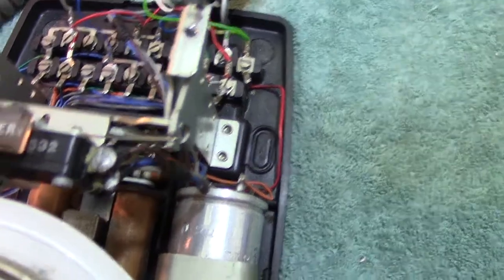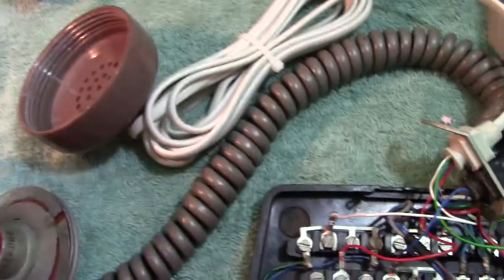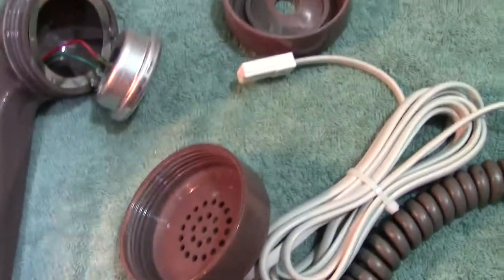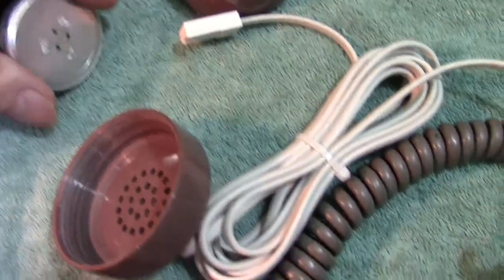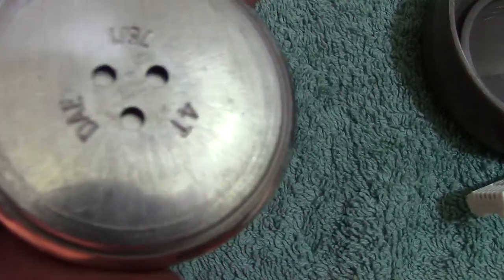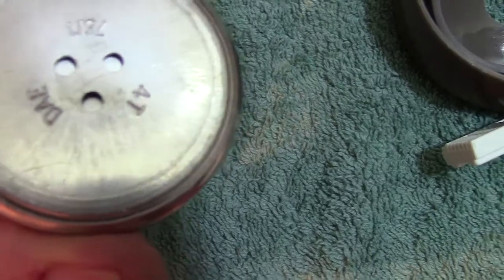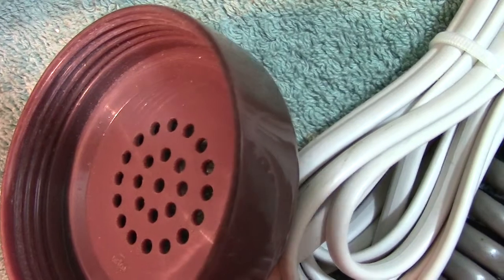Plessy and Ericsson were just one of the actual makers. Now, leaving the telephone part, we go on to the handset. It's interesting because the 706 type of receiver — known as a rocking armature receiver — is what is used here. They've in fact used the same one. It has not got a GPO mark or anything like that on it. As far as I know, this would have been the original.